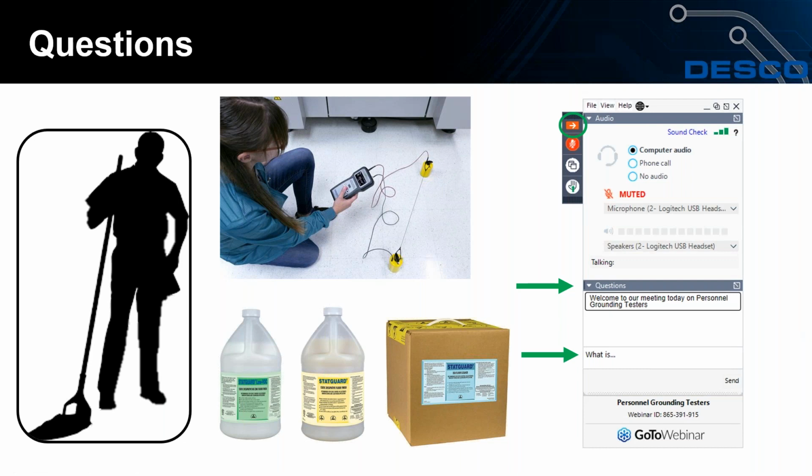Yeah. We do have a few questions that I want to relay to the wider audience. First one, how often do I have to recoat? So this is always going to depend upon the traffic level of the facility. But generally speaking, in my experience, roughly every month you end up having to go through a recoating process. Obviously, the thing that really drives that is the electricals. So if your electricals start to creep up towards 10 to the 9th and you're doing your testing on a regular basis, you'll know, hey, it's time to look at doing a recoat.